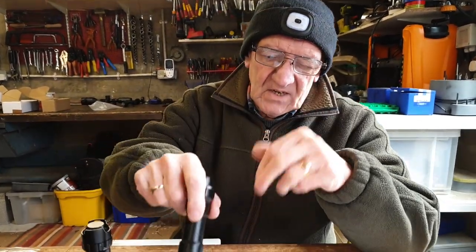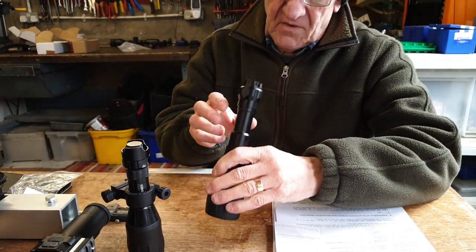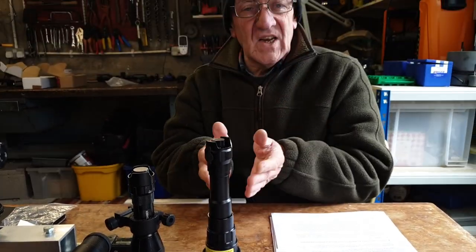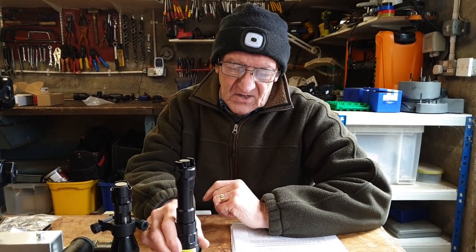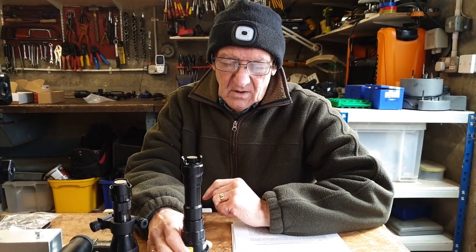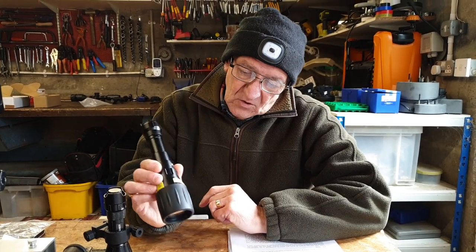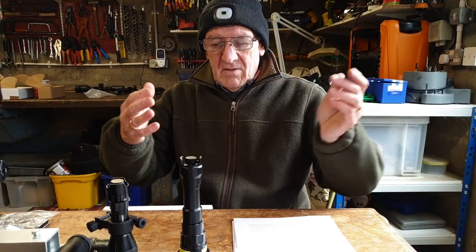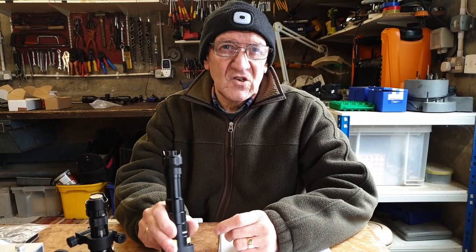Yeah. What happens with these things is that these DS35 and these torches, they don't emit these very tight narrow beams. They're designed to illuminate. They produce a much wider beam, so they can illuminate an area. And the standard recognises that, and it lays down some rules about what exactly these torches have to be able to do. In simple terms, how wide the beam is and how bright they are, without getting too technical. If the beam is wider than a certain size and the brightness is less than a certain limit, then they can be classed as conventional lamps.